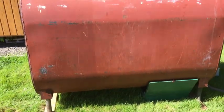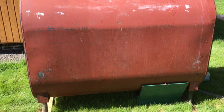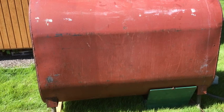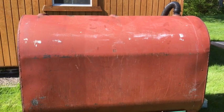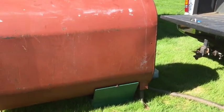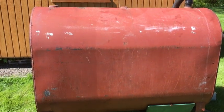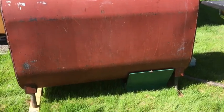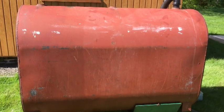Again, safety wise, some of you safety Nazis out there might say, oh, you shouldn't be putting fire close to the tank, etc. But the tank is clean, there are no fumes left in the tank, especially when we have exhaust from the truck running back through and circulating any potential fumes that might be left in the tank, which is non-existent. And I know some welders years ago used to do this exact same process for repairing metal tanks like this.